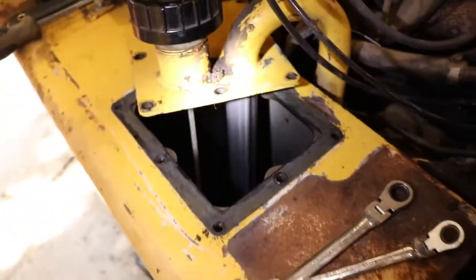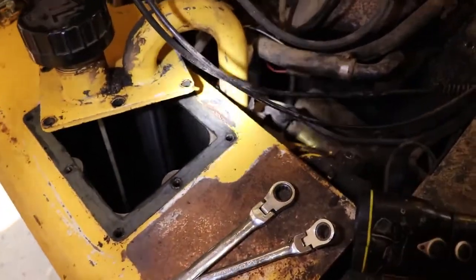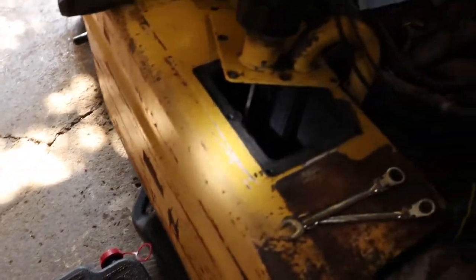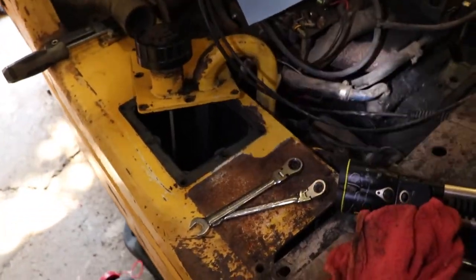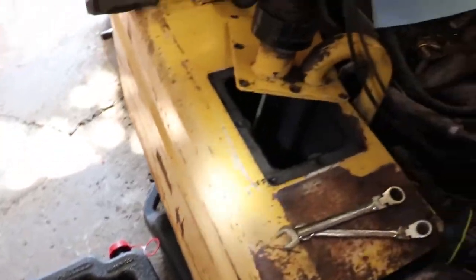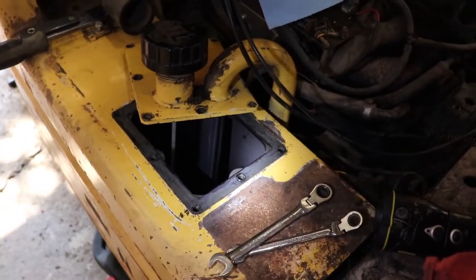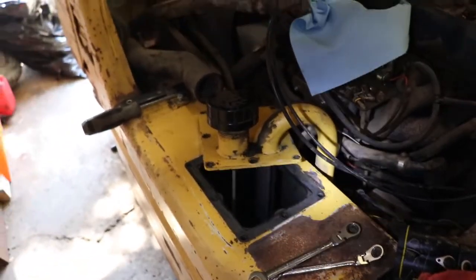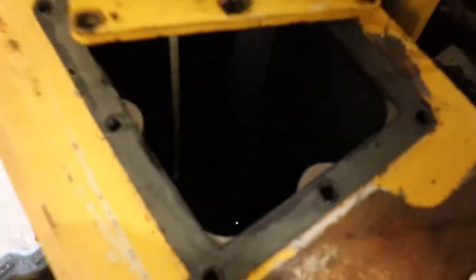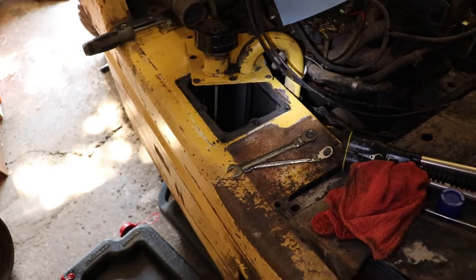That fitting is for the oil return, so I'll get that disconnected. I'll have to come up with some means to get that oil out because the drain on the tank down there is seized. You should have two drip pans — one for where the hose disconnects and one to drop the screen onto to work on it. It's not too big of a deal to do this job. To get the oil out you need some kind of means of pumping it out, and you'll need two pails.